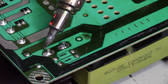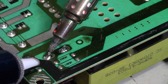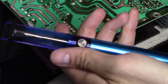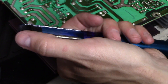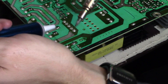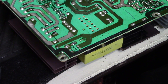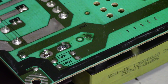Now if you're going to take out the solder, you want to heat it up — do the same thing. And I got my solder sucker right here. So what I do is on my solder sucker, I push down — it's a suction, basically a vacuum. Push down, press the button, sucks out the solder. So let it heat up until it liquefies, put it over your pin, and then suck out the solder. Did a fairly good job because it heated up really well.